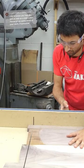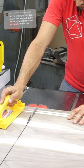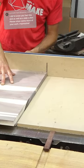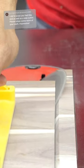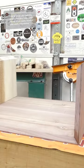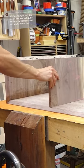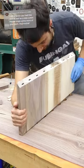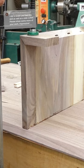We'll start by adding in the vertical components which will frame out the drawer cavities. I can rough cut them to length, verify the cuts are nice and square, and make any tweaks as necessary. I'll cut a 45-degree bevel on one end to get it to exactly the same height as the case sides. With all the cuts on these tall dividers complete, they can be joined to the case. I'm using the domino again and using a piece of MDF with parallel edges to place the divider parallel to the sides of the case.